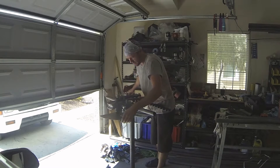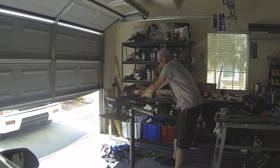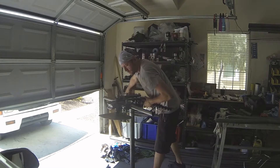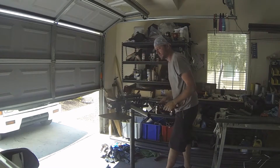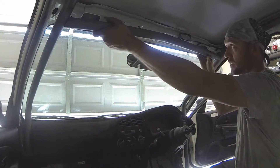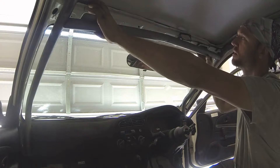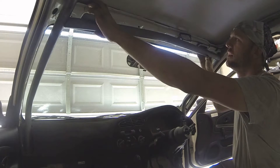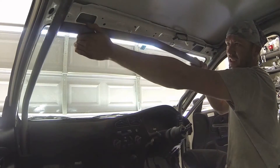This isn't much of a bend — I'm going to start out at 10, maybe 15 degrees, just a couple of little cranks here. There's 10 degrees — let's see how well that fits. You know what, 10 fits surprisingly well, but I think I'm going to go one more — I'm going to go to 15 degrees, just to really sneak it up there. I'd rather be more out of the way than in the way, so I'm going to stick it back in the bender and give it 15 degrees.